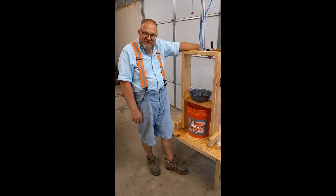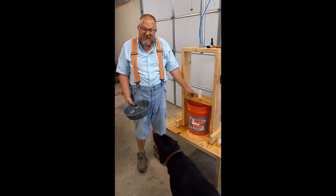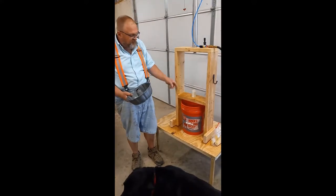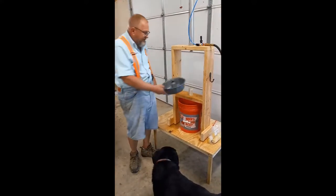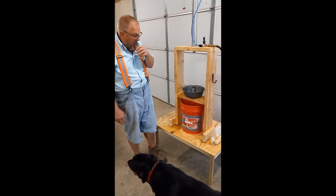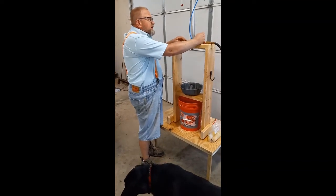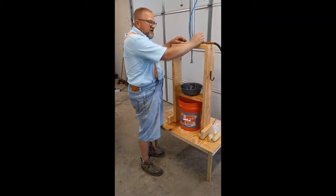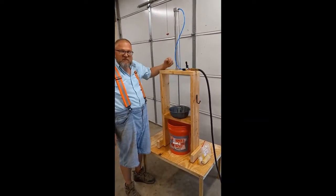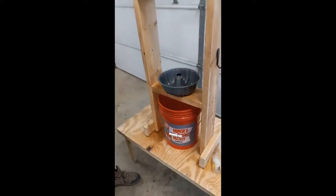We have made some modifications. I have a piece of PVC. I drilled a hole to one and seven-eighths, and the one-and-a-half PVC fits in there tight. There's a one-and-a-half inch hole at the bottom for the corn cob to go out, and then this fits on there and gives it some stability. I also reduced the travel of this piston by using a piece of half-inch PVC — about four inches long — to keep it from going all the way through. Those are the big changes.